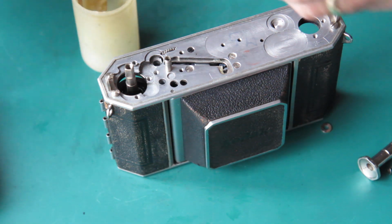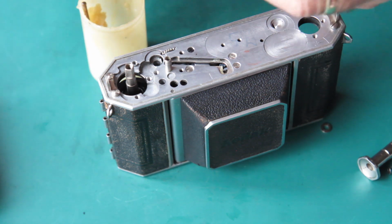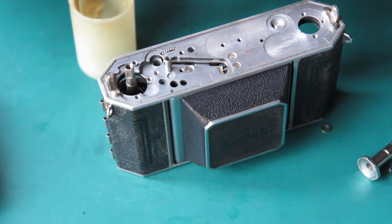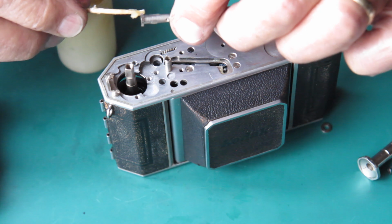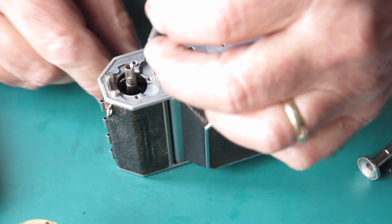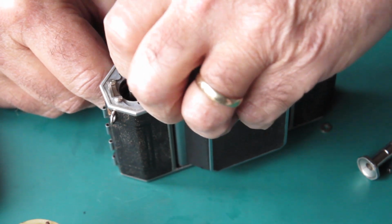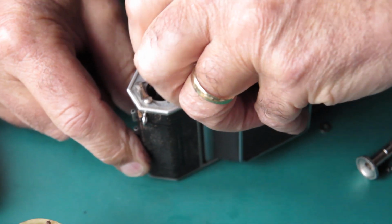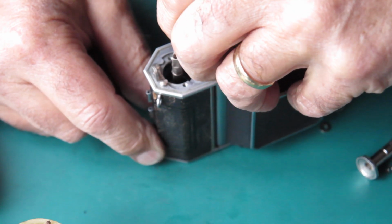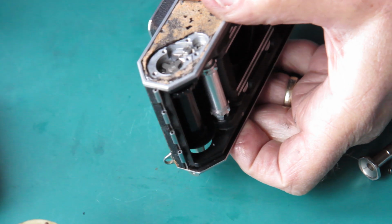And the sprocket shaft itself, I'll lubricate the top part of that with some synthetic grease. The bottom part with some synthetic grease, that's where it runs through the body casting. Usually I'll put a wipe on the little pinion at the top too, where it couples to the film advance. That slides down through the sprocket and it's sticking on something. I think that screw hole in that thing was burred.